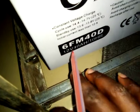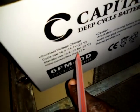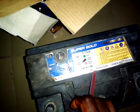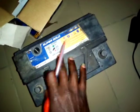This is my battery — 12 volt, 40 amp. I'm using 13.8 volts as the charge controller setting. This is a deep cycle battery. Please do not use a car battery. Here's an example of a car battery — it's 75 amp — but no matter how good it is, it can only give half its rated capacity. So 75 divided by 2 is about 37.5 amps, whereas this deep cycle battery gives the full 40 amps.